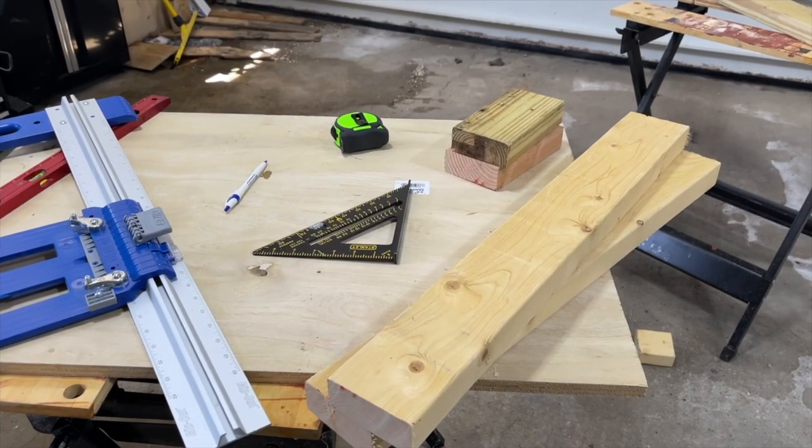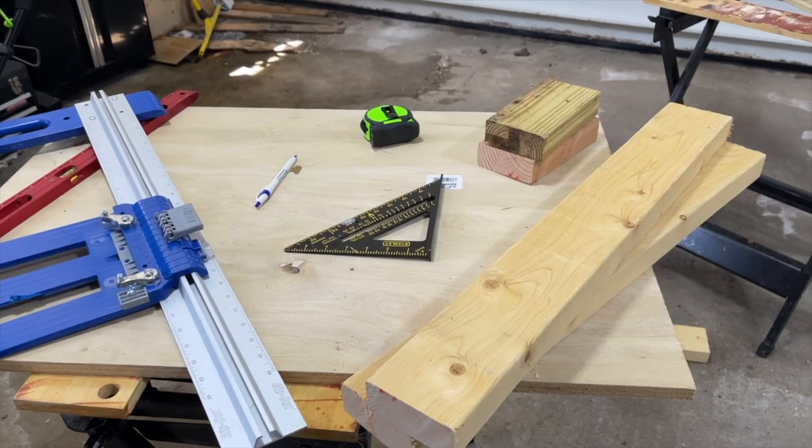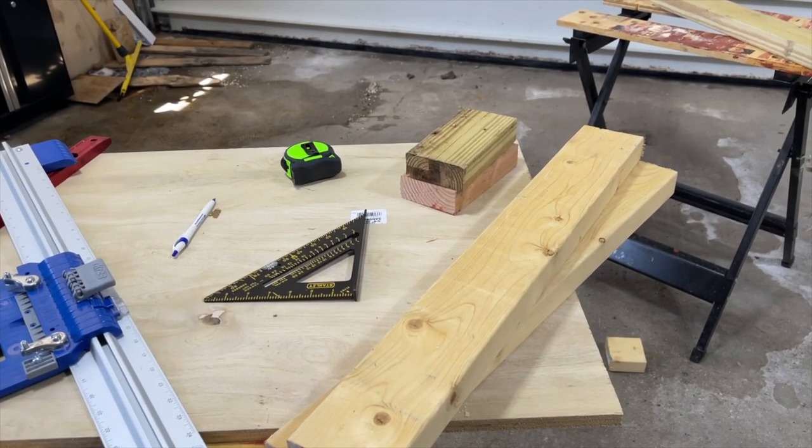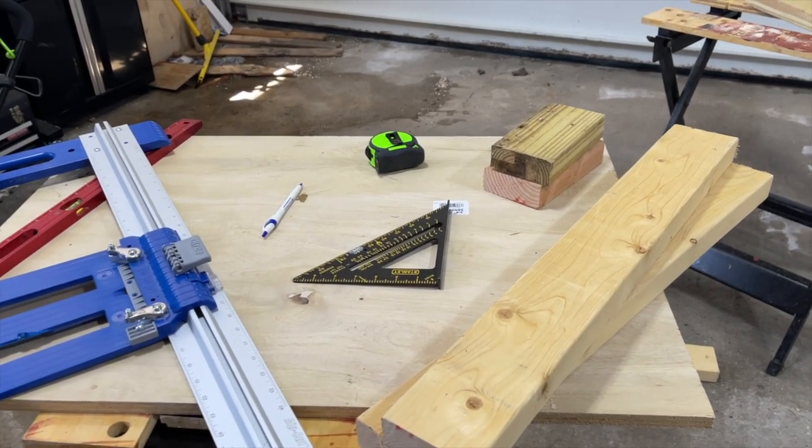This hive did come unassembled. Most of the pieces are pre-cut, but there are a number of different steps involved to get it to assemble and align correctly, such as building a jig for the sides for both the top and bottom pieces. To build the jig you need three-quarter inch plywood, some two-by-fours for the sides, and also some two-by-fours for the middle uprights so that you can align everything.